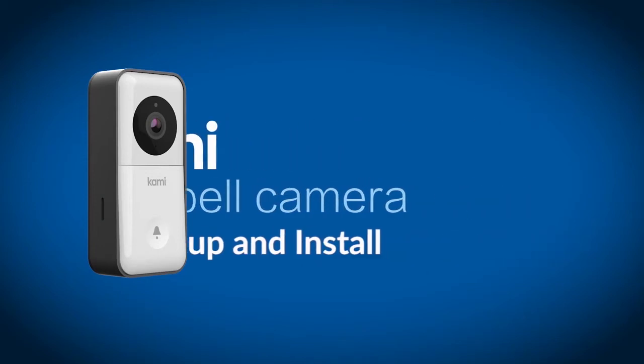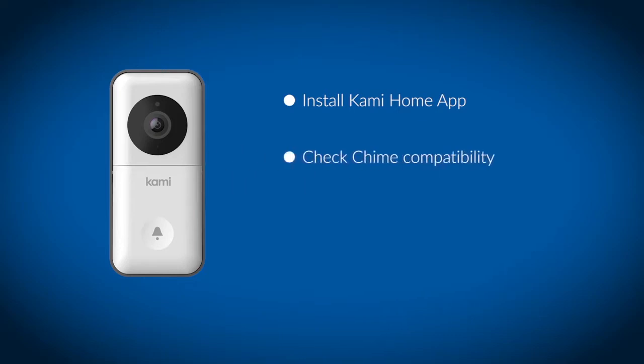There are a few things to check before we go ahead. Install the Cami Home app from the Apple Store or Google Play to download the free Cami app. If you are planning to connect with your current chime, please check if it supports 8 to 24 volt. Find a location for installation, or you can use your existing doorbell wires.